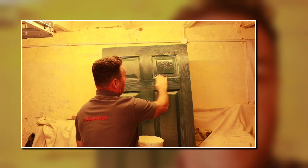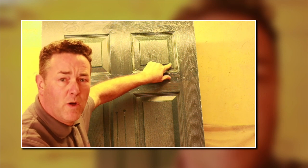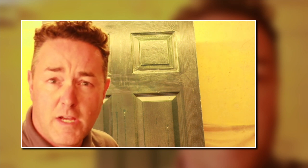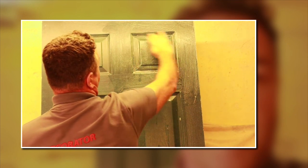Use your fingers to get into the mouldings. I'll zoom in so you can see. Rub across, but don't press too hard on the corners where the paint may be thinner — you could rub through. Work around and up and down. Remember, you're not trying to remove all the paint. The main thing with rubbing down is you're providing a key — the mechanical grip for the new paint to adhere to.